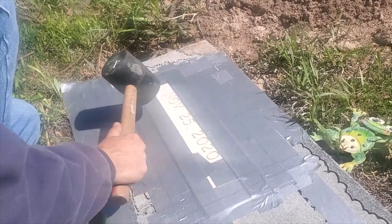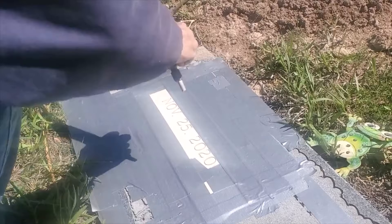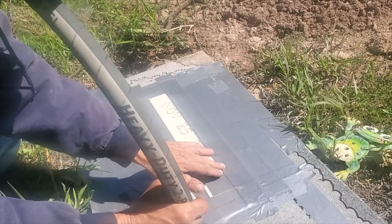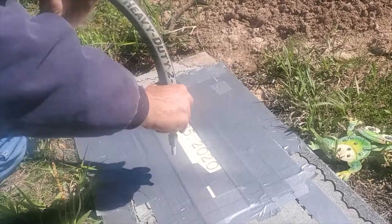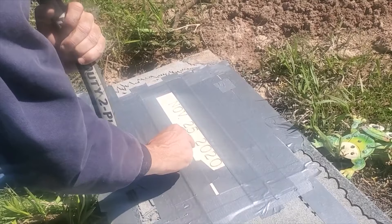One of the other things I'll do to keep the tape from peeling back is when I first start, I'm going to move in a circular motion around the outside, kind of using the sandblaster itself to secure it down on both ends. All my work I'm going to keep in a circular motion, and when you're doing this you can actually never stop moving — if you stop moving, it will blast through.